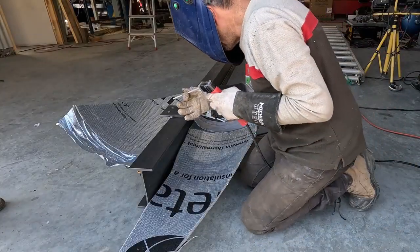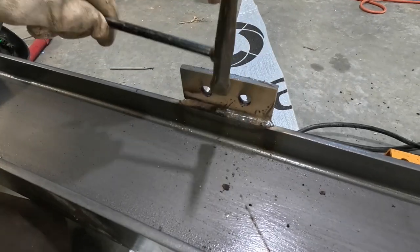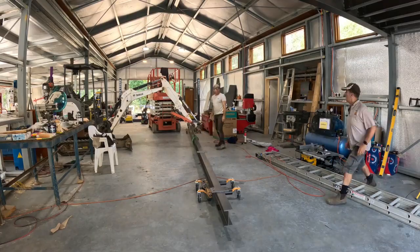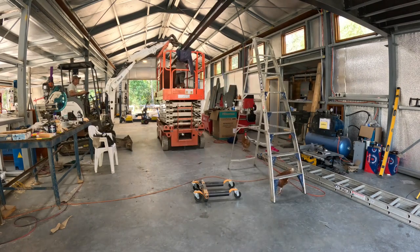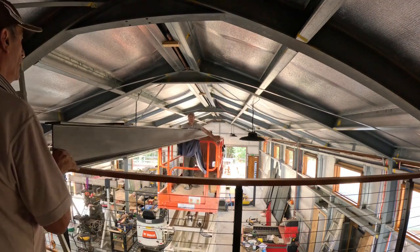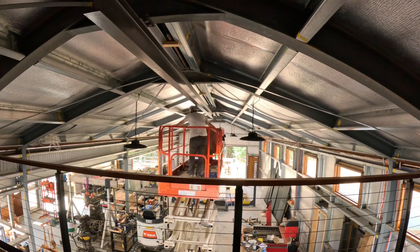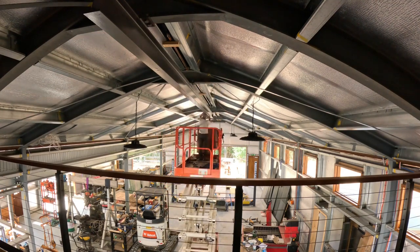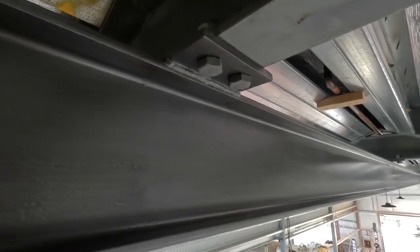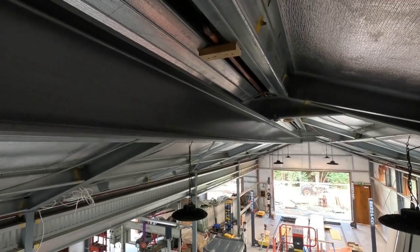The last thing I wanted to do is the main lifting beam — it's eight metres long. I bolt this to the main roof trusses. I lift it up with the excavator first, put it onto the scissor lift, which can lift about 450 kilos, and that beam was about 300. Then bolt it up, and that worked out perfectly. That is basically the last beam of this build — from here it's really just finishing the interior. In the next video I'll build some custom barn doors and I'll take you through the final sign-off process. See you next time.